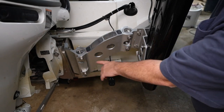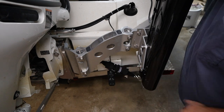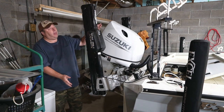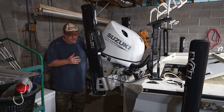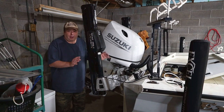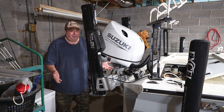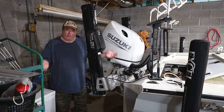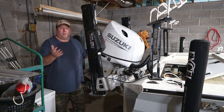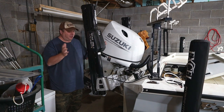All the large bolts are torqued down to 50 foot-pounds. The ones on the jack plate are 80 foot-pounds, and it says not to over-tighten the ones on the actual Talon brackets. That is pretty much it for the Talon install. All that's really needed is maybe loosening all four of these bolts and having it go up or down — probably down a little bit. I will have to get it on the water to see where it needs to go. I just need to make sure it will clear the garage to get the boat out for a guided trip.